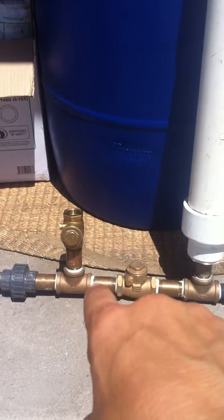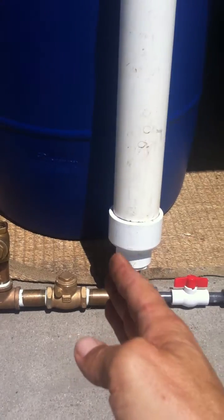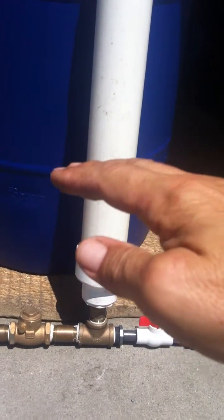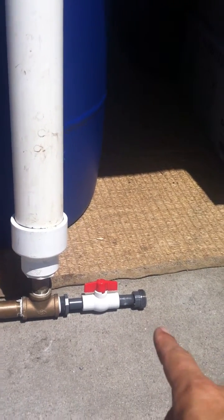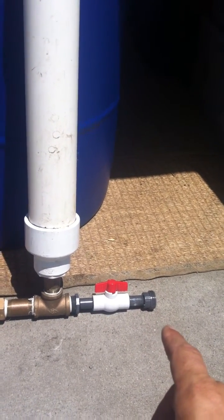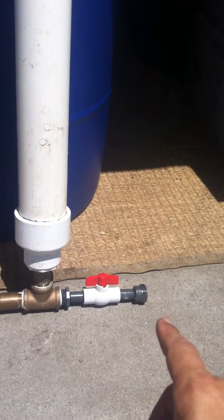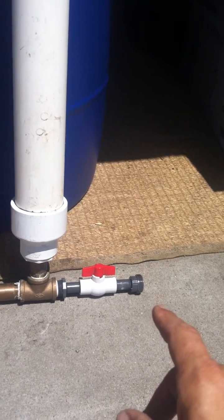That's a little check valve that slams open and shut, and that's another little check valve to keep water moving this way. This is the pressure chamber that keeps a certain amount of pressure built up to keep the water moving out. This would attach — the first incarnation I had a three-quarter inch delivery hose.